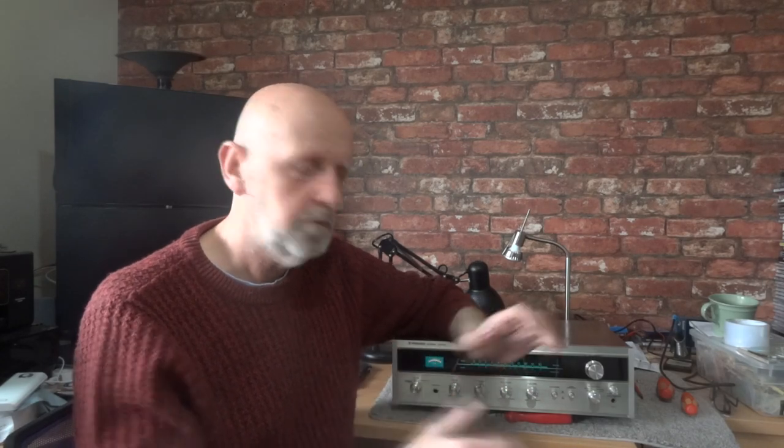I've done some preliminary tests to diagnose what's happening. First I checked whether the fault was on the phono stage by switching to phono with nothing plugged in, headphones on, volume at zero — and the noise was there. Then I switched to tuner and auxiliary. On all three inputs the noise was present. So it's not just the phono stage — it's across all inputs. If it had only appeared on phono and disappeared on the others, we'd know it was the phono stage causing it. So we're going to eliminate the phono stage.